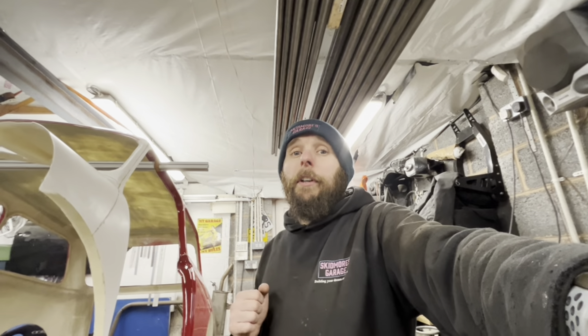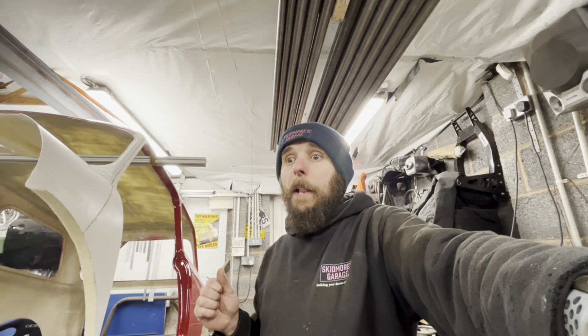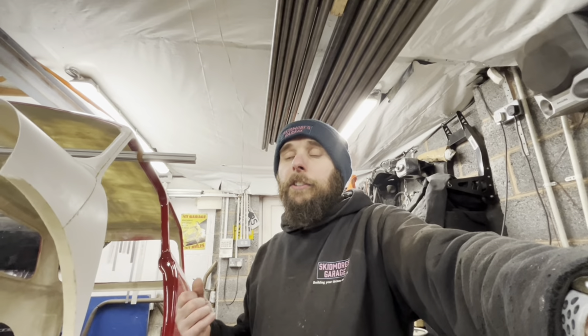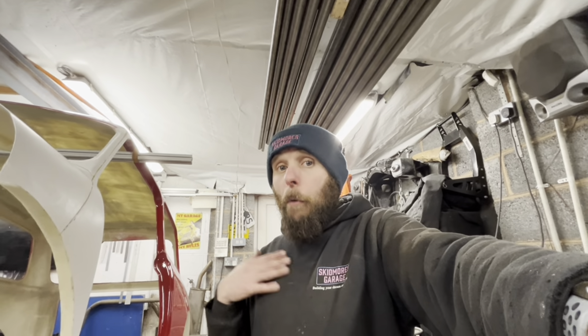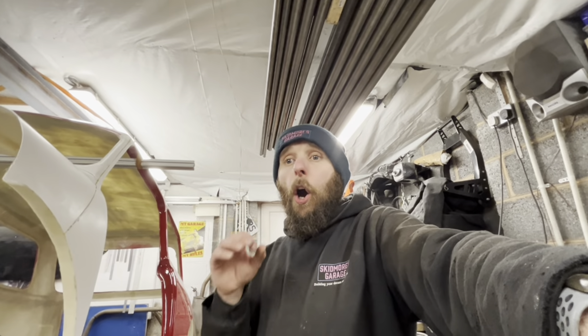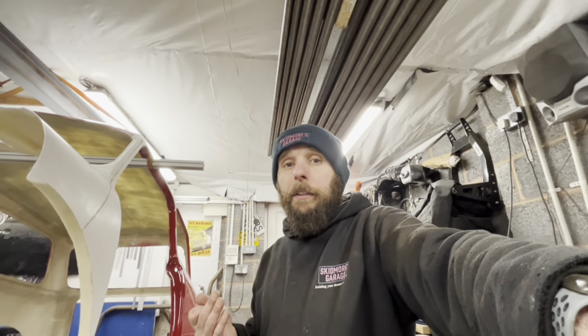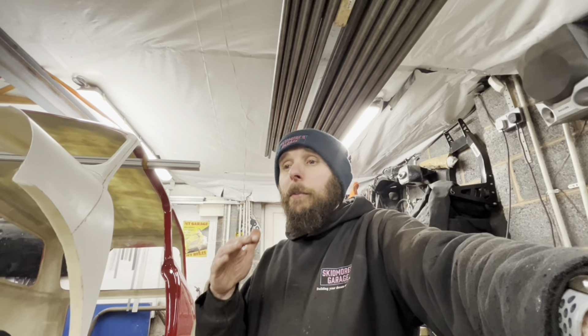In my opinion, it would not be strong enough, because this stuff in the bender bends so easy. You watched me bend that one inch earlier — that's harder to bend than this stuff. This stuff bends so easy, so I couldn't say whether it would be good enough. But in my opinion it wouldn't be. This stuff I use is proper ROPT — Rollover Protection Tubing — and I'm using the proper wall thickness for the job.